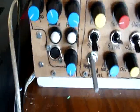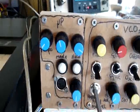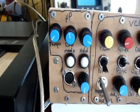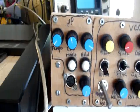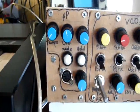So we look now at the front panel, which is very much a work in progress, as you can see. On the left here we've got the controls for the Arduino. We've got the tempo, which controls an internal oscillator which generates an LFO, and also the arpeggio. If you feed MIDI in though, however, it becomes MIDI synced, which is nice.